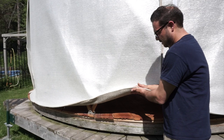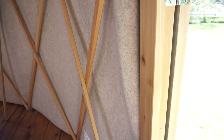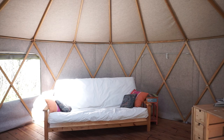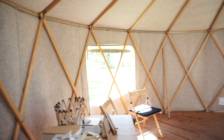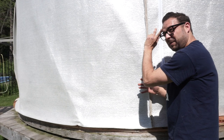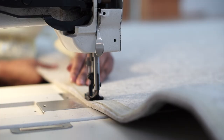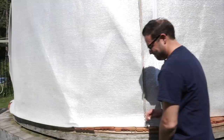This is 100% wool felt — sheep's wool — needled to a very specific density and thickness. This is a technical felt needled to a radiant layer in the back. It's bringing the Mongolian tradition of this beautiful, warm, rich wool felt — very luxurious — giving us thermal insulation, but marrying that to a more modern reflective insulation. What you'll find in a more modern yurt made in North America is typically bubble wrap with a radiant layer, which is effective but doesn't breathe. In our climate, breathability is absolutely critical — maybe the number one thing you consider in a yurt. Wool felt is hard to beat as a traditional material.